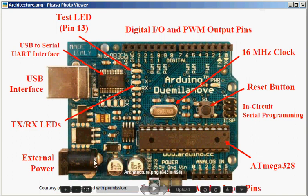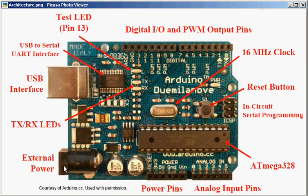You have an external power supply input — a 9V power supply can be given here, and you can also use a battery. You can also power your Arduino through the USB interface using 5V.